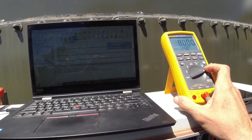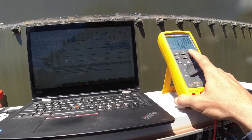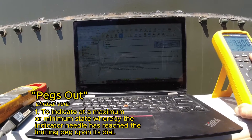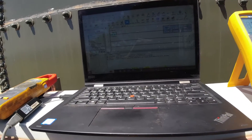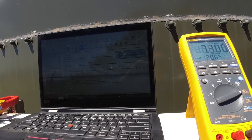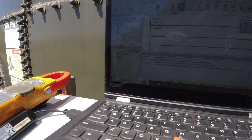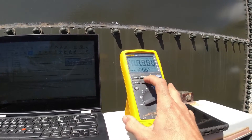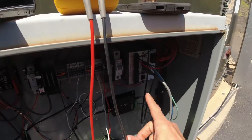At 8 milliamps it's only 7,500 raw value — that's wrong. At 4 milliamps it pegs out at 6,553 around 7.3 milliamps. So at 7.3 milliamps the raw value bottoms out at 6,553 to 32,776 — essentially 6.5k to 32.8k. We should bottom out at 4 milliamps but it's bottoming out at 7.3. Does that point to the analog module — the actual analog input module in the PLC?